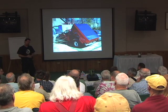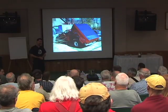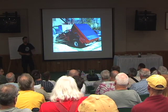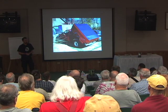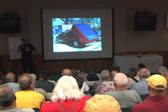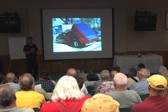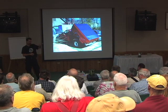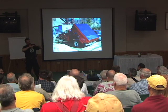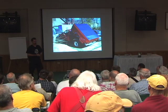Would you go with the individual charging cells or go with the big charger? The difference between one big charger versus a number of small ones — with used batteries, I might go with individual chargers, because if one battery is a little better than another, each battery gets treated individually and gets its own special treatment. Whereas if one battery is not so good and you're using a series string charger, that one cell is not going to be as happy — it's going to get not charged enough, or the other ones are going to get overcharged.